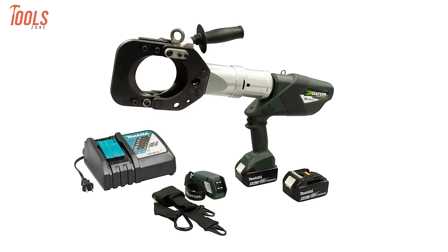Meet the Envy Mechanical Cable Connector. Speed up medium-voltage conductor connections with this connector. Its unique shear head bolt design enables watertight aluminum-copper crimping fast using basic hand tools — no more messy post-torque grinding or complicated compression equipment rentals. Its ingenious stepped bolt thread ensures the perfect cutoff point every time for uniform crimping forces. Stress-free installation now allows electricians to simply tighten the hardware to specified torque and let the precision-machined bolt head shear clean off. Inline sealing caps and centered rings keep water out for maximum reliability.